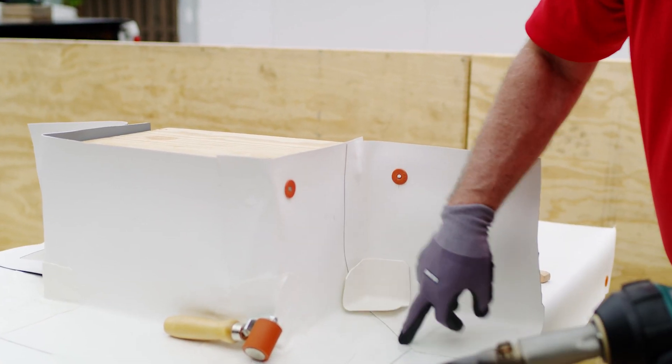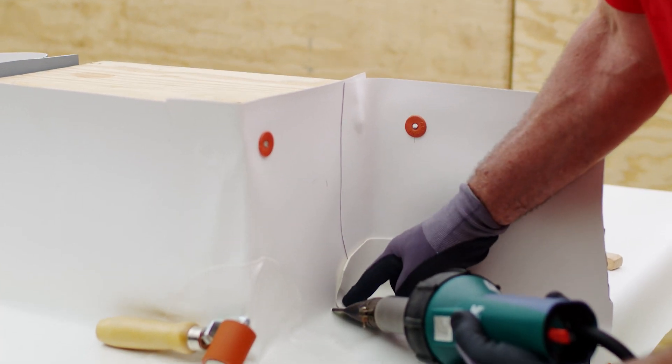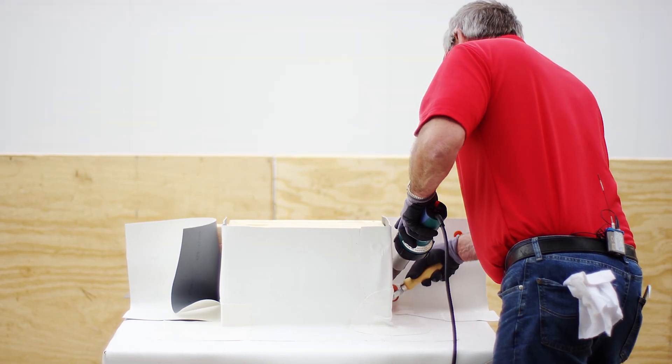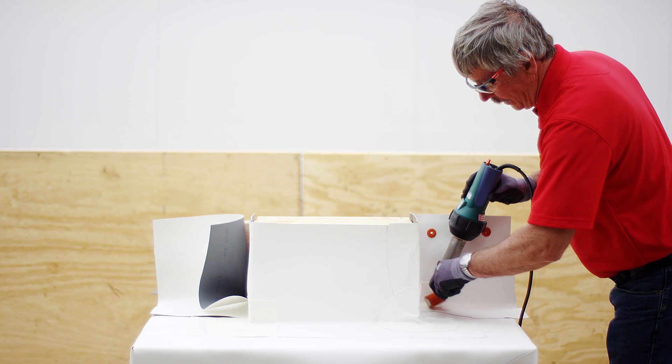Here I'm going to have to worry about a T-joint right here. I'm going to go way back in there and make sure it's nice and tight with that angle change. Now it's just a matter of doing these little ears right here. I have a seam right here, so again I have another T-joint area I really have to pay special attention to. Show your inspector those creases. Always pull back to get to your good weld.